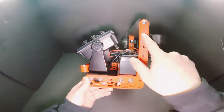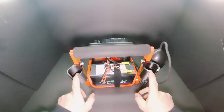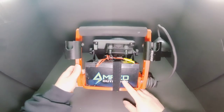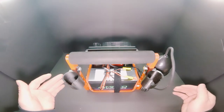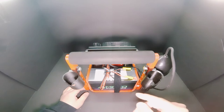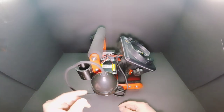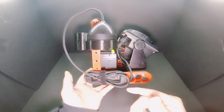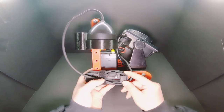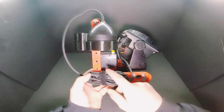As you can see, the large shuttle has a bigger arm — this regular one is a lot skinnier and you're more limited in what you can do. In the back I don't have the accessory bar but I do have two rod holders. I'm also running an Amped Outdoors 6-amp battery, which lasted over eight hours this past weekend and I'm still at 13.1 volts. I also have my ProView transducer holder from Bass King, which is really nice. I do recommend the cord organizer for the BK shuttle — I have it on both and you can wrap your transducer cord neatly and use the velcro strap to tie off the wire.